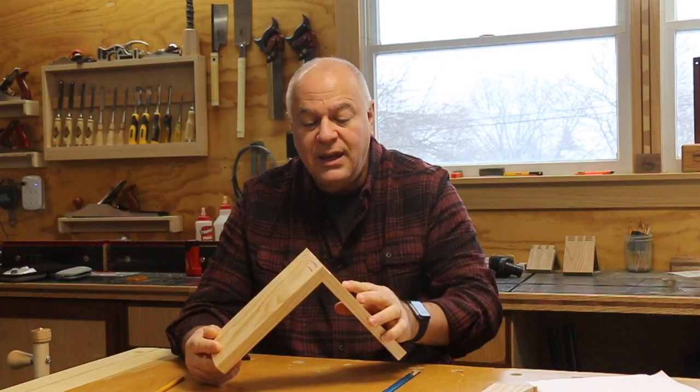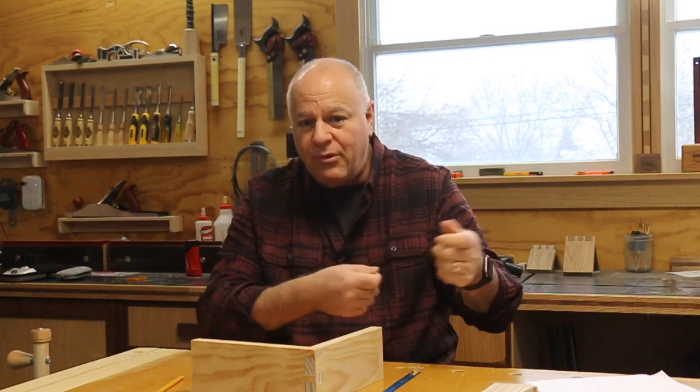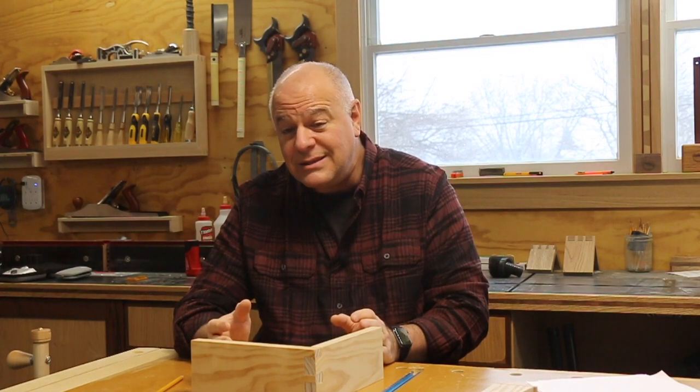A couple of points to consider before deciding whether or not this is cheating. First, if you're new to cutting dovetails, I could see an advantage of using the bandsaw first — it helps you make sure you're starting with perfect tails, and then you can practice your skills by doing the handwork to cut the pins. Second, if you have a lot of dovetails to cut, this is going to be a little bit faster. Third, it's still two thirds, if not more, of the work done by hand, so technically you're doing the majority of it by hand. I'm curious of your thoughts.